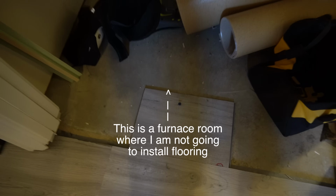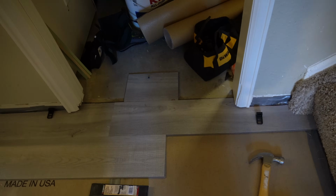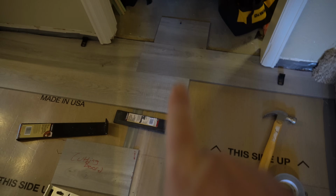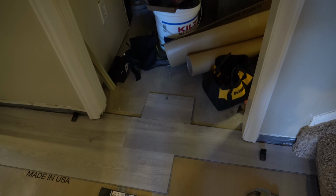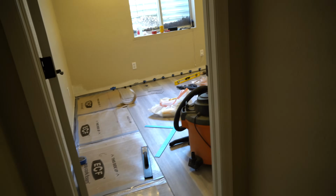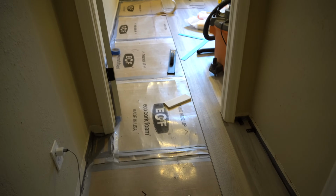So I had to put another anchor block in my hallway to make sure that this stays in place. As I am finishing out this hallway and tightening up by pushing this way and this way, most of the time these aren't going to move and everything isn't going to come out of place, and it'll actually stay on this line. Because as you work your way down, I start putting pressure here, it's got backing over there, but not here. And then what will happen is this line will start to be off on an angle and not work out the way that I wanted it to.